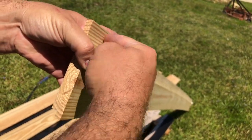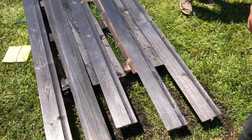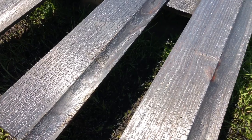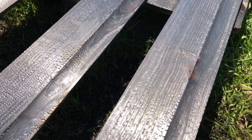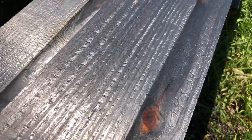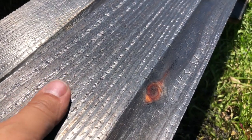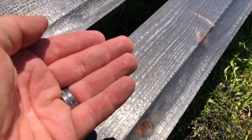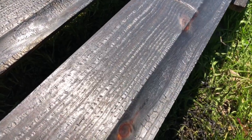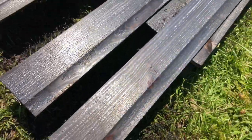The top piece fits into the notch of the one below, leaving a neat little concave alcove. The effect we're going for is a light crackle char — we're charring it until it's completely black with just a little bit of crackle, not a super heavy crackle. For a wall inside, you don't want it rubbing off. After you clear coat it, a really heavy burn will be soft. So we just want it black with a light crackle, and then once these cool we'll clear coat them.